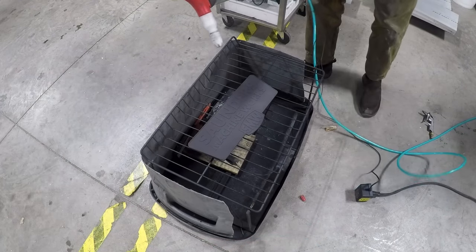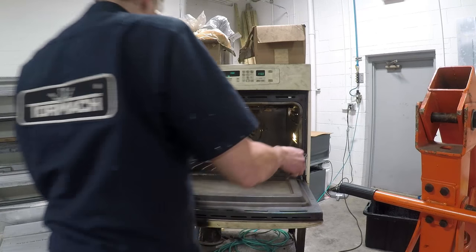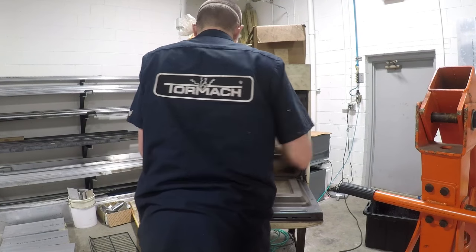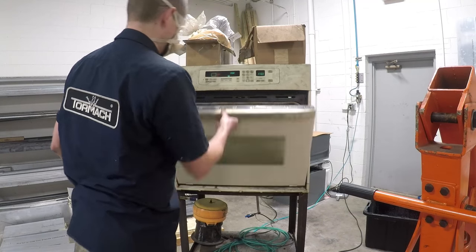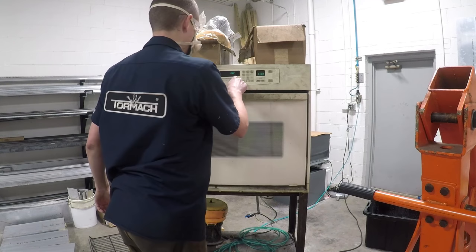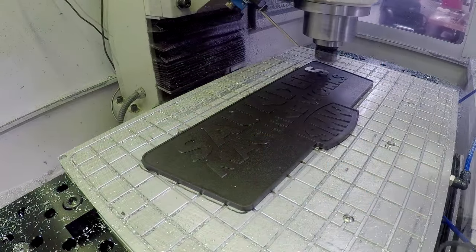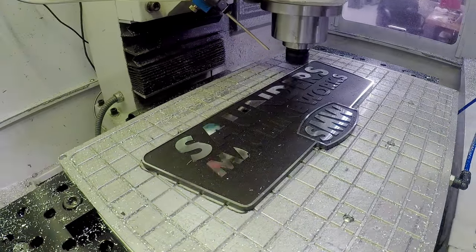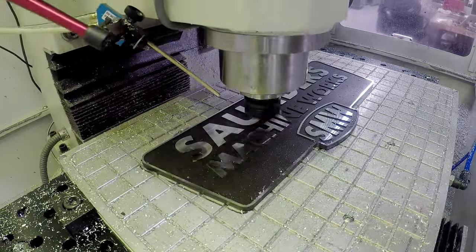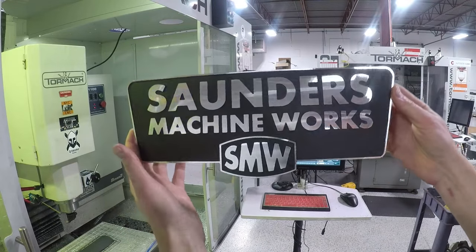We actually did a powder coat video showing how easy it is to do this stuff at home or even with a small toaster oven. Normal, just 400 degrees, 20 minutes for what do they call it, flow out and cure. I'm a very beginner powder coater, but it's really not hard to get the parts to look good. And you can kind of see the texture here, and then this is what's awesome. Super fly off the finish. It looks so good. Not half bad, right, folks?